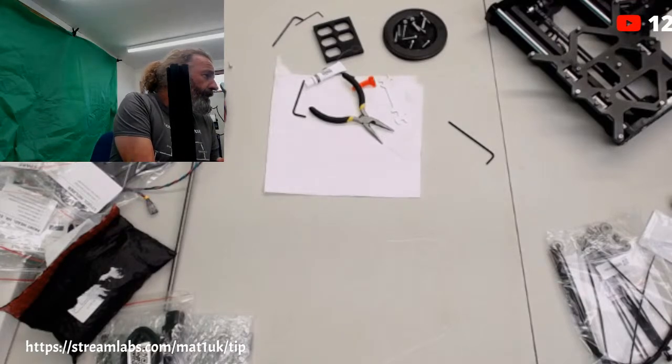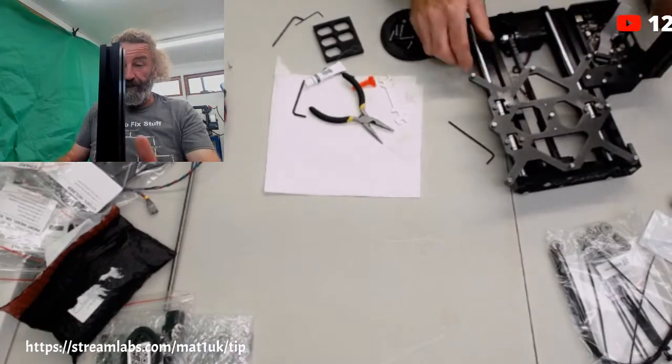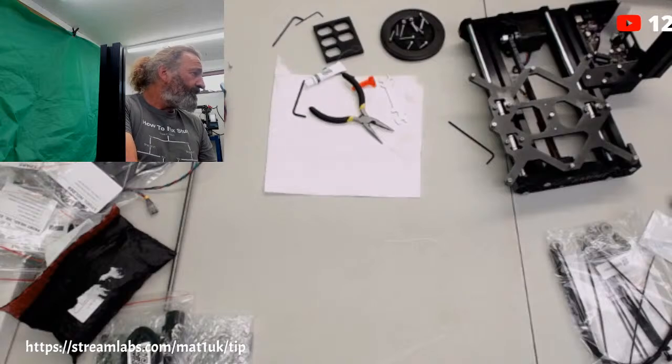Aligning the Z-axis assembly. In this step, you will move the entire Z-axis assembly. Avoid pushing, grinding it against the aluminium extrusion, or you might scratch it. Leave a small gap while moving the parts. Right. Okay, rotate the back of the printer towards you. So the back of the printer is towards me, like that. Hold the Y-axis assembly. Move the Z-axis assembly to the back. There is a notch which indicates the correct mutual position for both parts.